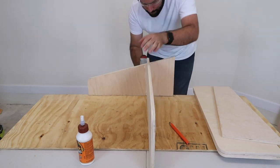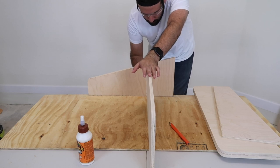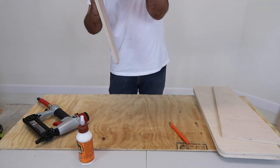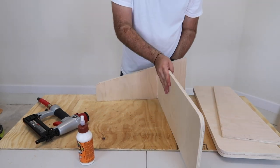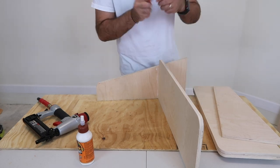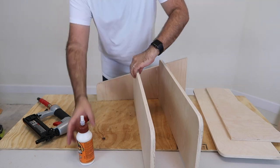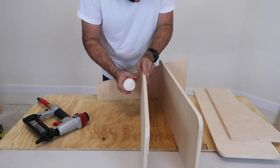Make sure that your boards are always straight — they may get a little bit of a jiggle because you don't have the other side yet, but as soon as you put on the other side they're all going to end up very straight. From here on it's very simple: just repeat the process for every shelf — put some glue, then put your guiding pins and keep going.